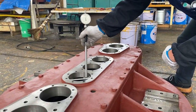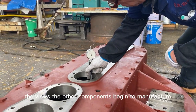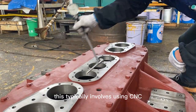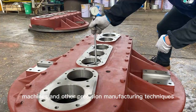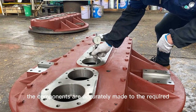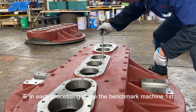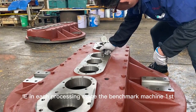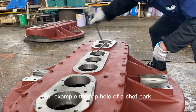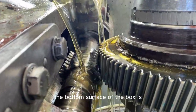Manufacturing: Once the design is finalized, the gears and other components are manufactured. This typically involves using CNC machines and other precision manufacturing techniques to ensure the components are accurately made to the required specifications. Step 1 is benchmarking first — in each processing stage, the benchmark is machined first. For example: the top hole of a shaft part, the bore of a gear, the bottom surface of a box, etc.